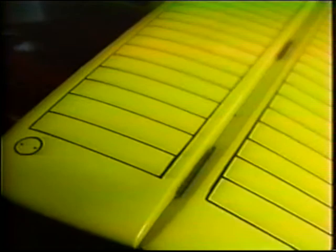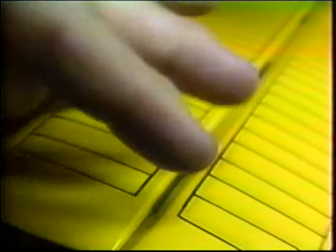Now, I hope with all those tips, and all that emphasis I had on nice controls, you'll get really perfect little hinge pockets. This is from the Griffin. Perfect, and all the hinges lined up as if they were one piano hinge, all in one.